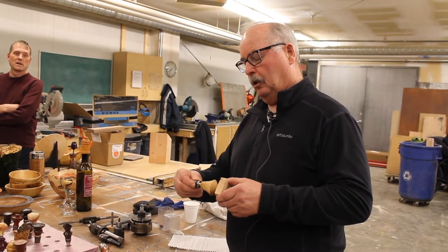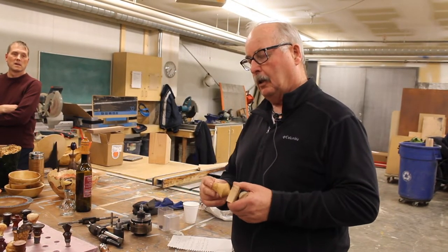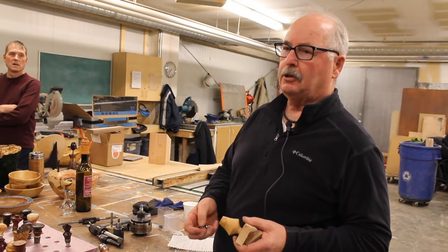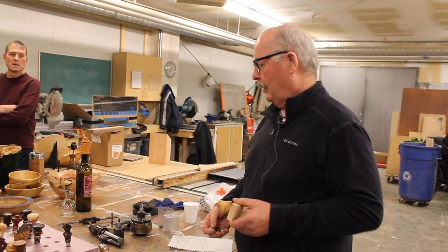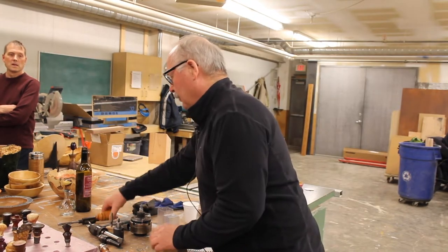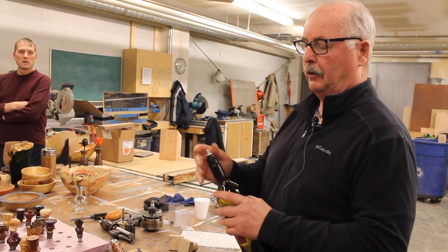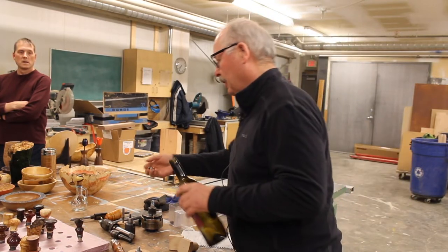You can make a little dimple on the base of these with a 7/8ths drill — it's inset a little bit so you don't have to worry quite as much about it lining up properly at the bottom. If you make a very small bottom on it, it might show a little bit of crookedness. With that little dimple you can only go about 1/16th to 1/8th of an inch — other than that you're going to interfere with your bottle. If it's deeper than that, it might bump against this, and if you made it too deep, it would catch on your bottle.